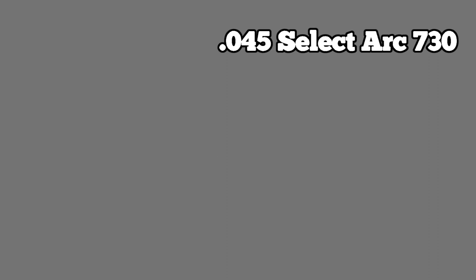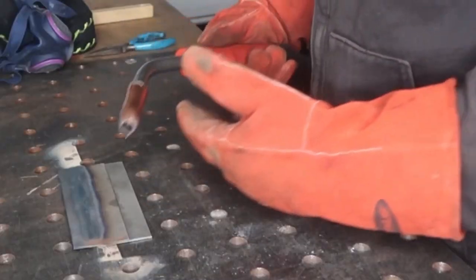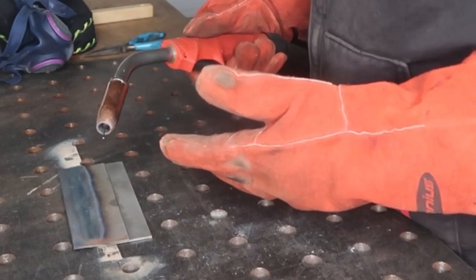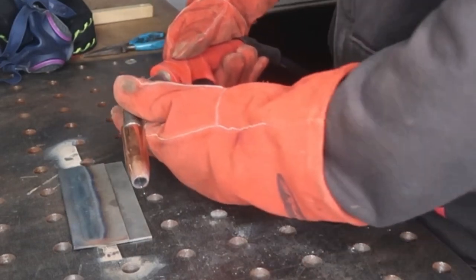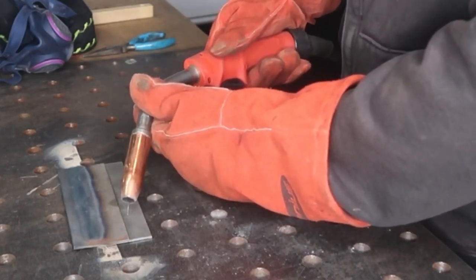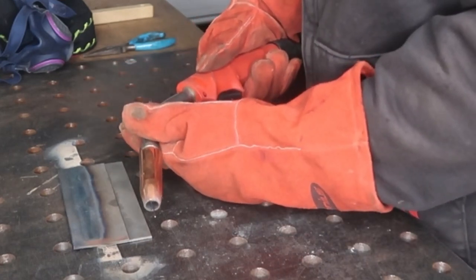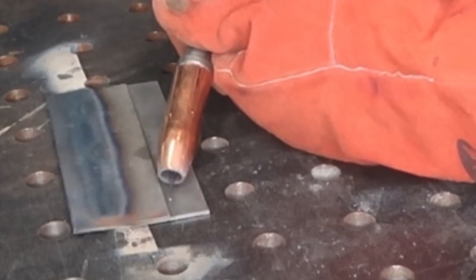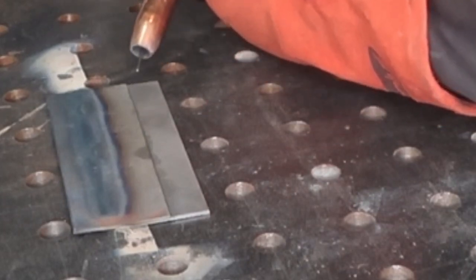045 dual shield flux core with 100% CO2 on 110 power. Getting comfortable with your position and the way you feel with the torch is the number one thing. What I do is I put my elbows tight to my waist — the reason why is I'm not free-floating, which can cause a missed weld area in the weld joint. So I get my elbows really tight, make sure I can slide across the base plate, put my wire in the joint, and slide across moving my body — not just my arms.